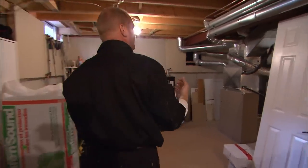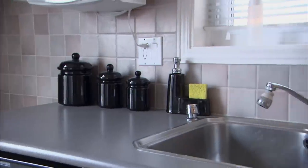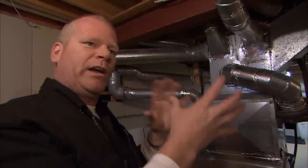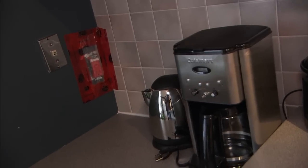I'll bring in Frank, my electrician. He's going to take a look at the place and see what the other contractor has done, and possibly what Neil has done here. Neil mentioned the dishwasher was hooked up to other lines — it shouldn't be. The receptacles on the counter are supposed to be on their own dedicated lines. Where did those lines go? Things like your dishwasher and your counter plugs need their own breaker — they have a heavier load. What they've done is simply done the addition and tapped off whatever circuit was available, so every time you use the coffee maker and dishwasher at the same time, you trip the breaker.